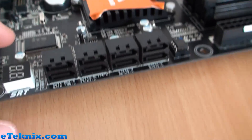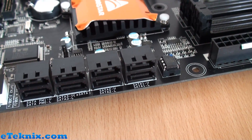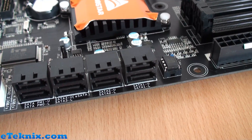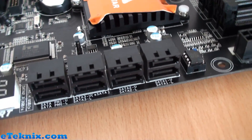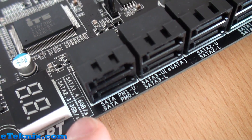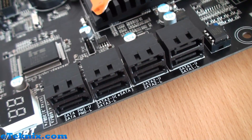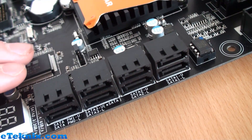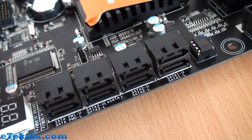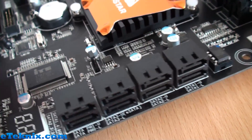In terms of SATA ports, we've got 8 in total. Some are SATA 3 and some are SATA 2. SATA ports 1 and 4 are 6 Gbps; SATA 2 and 3 are 3 Gbps — it does tell you just down here the support on that. There are 8 ports in total and they've all got various codes indicating what each SATA port is. Once we have the full review, we'll tell you exactly which ports are supported by the Intel Z77 chipset and which by a third party, if any.